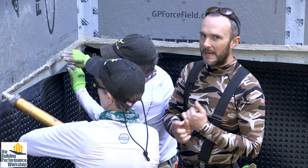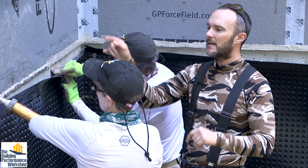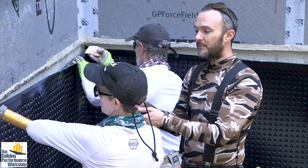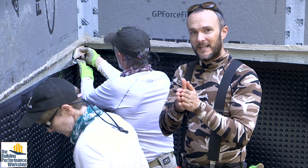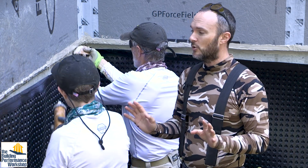This is polyurethane based, not silicone based. The polyurethane base is important because we want the tape that we are going to, in some places, be applying again for the rain screen to be able to stick to this. And the polyurethane formulation will allow that. The silicone has a tendency to reject and not allow other things to stick to it.